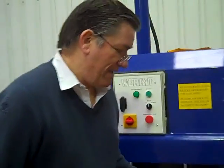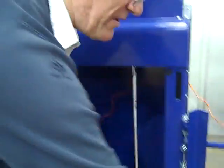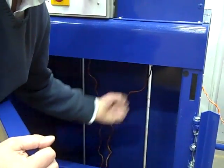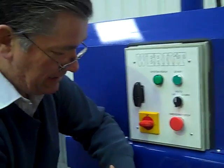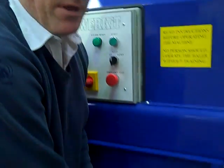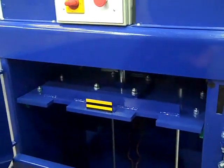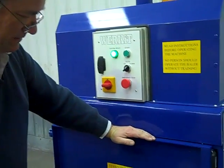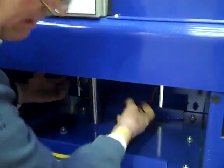A little bit of troubleshooting. If ever something gets stuck in the baler — some cardboard gets stuck in the pressing plate when the plate's going up and down — what you do is, let's say the door's shut and you've got some cardboard stuck in the plate: if you can't pull the cardboard out from underneath the plate, all you would do is close the door, switch the machine on, give the plate a chance to go down a little way, and then if you open the door, as soon as this magnet loses contact, the door stops and you can actually reach the cardboard from the top. If it's not far enough down, keep it on down and make it go down a little bit more. Then you can get anything that's been stuck out from the top as well.